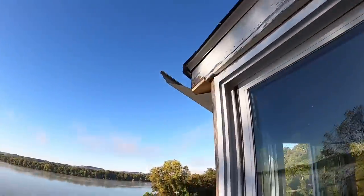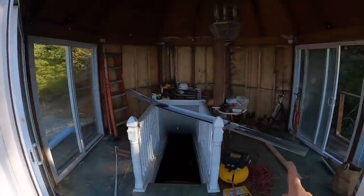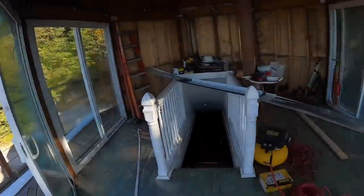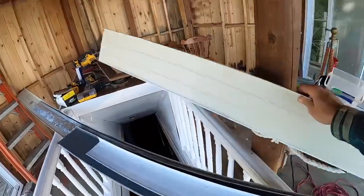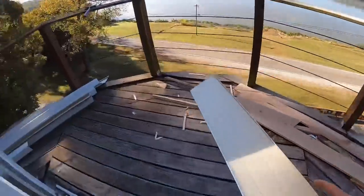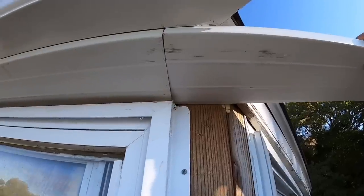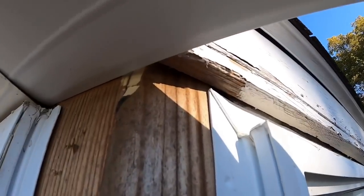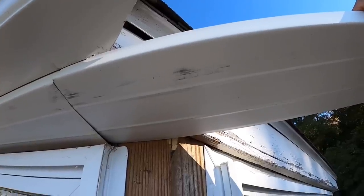So there was no reason for me to take that 6 inch piece and use my full, which you can see I've got there. It was better to use a short piece. And then we'll come in here, we'll grab another short piece of 6 inch, and we'll use this short piece to fill in this short piece, and then we're wasting much less 6 inch material, because I've got to trim it down, remember, again to 1 inch over here. So that 6 inch is going to be 6 inch on this left hand side, and then once I make the break and bend it around, it'll be 1 inch. So this is going to be a funky cut, but let's get her cut and get her installed.